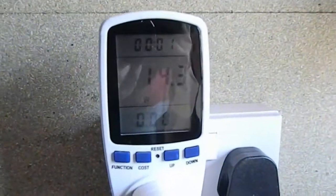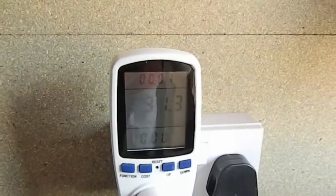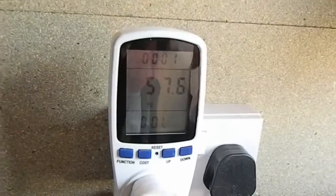So we've now enlisted the help of two Xbox 360 power supplies, which together can provide 28 amps continuously. As this voltage drops here, the watts are going to rise here, because as the voltage of the battery comes down to 12 volts, they will pull more power, and as it drops below 12 volts they'll pull even more. So this is going to gradually rise and take up the power that the battery can't supply. And it keeps rising.